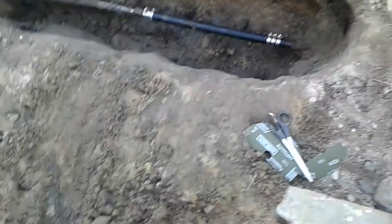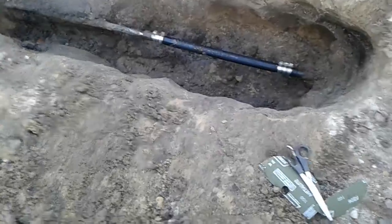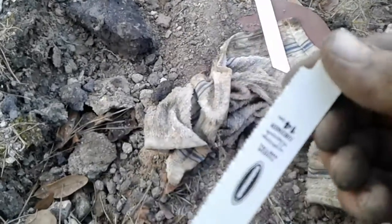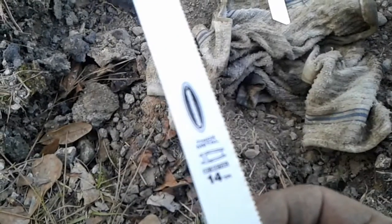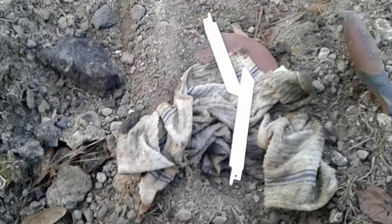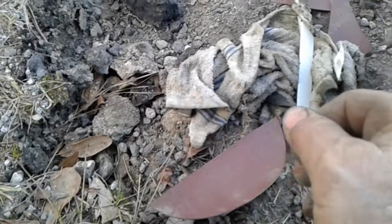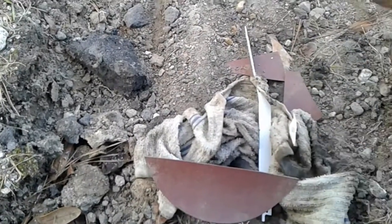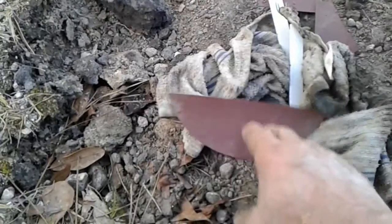And when I cut that — that is steel — this is what I used. One of these cheap packs from Harbor Freight, a metal cutter. It came in a pack where you got three different types of blades, and it went through there very easy. Use a short blade, not a long blade — you're going to run into trouble with the vibration, it's not going to work. But to clean it, I had these discs, and I cut strips and kind of like you got a scrub towel and you're scrubbing your back — I was doing that with these.